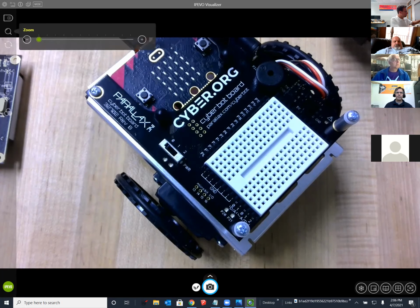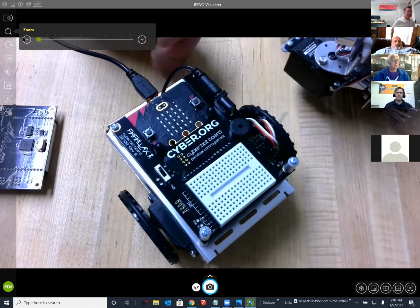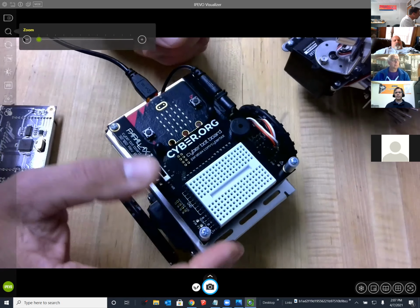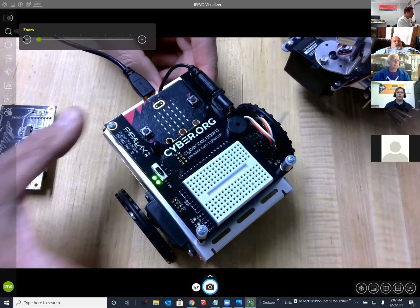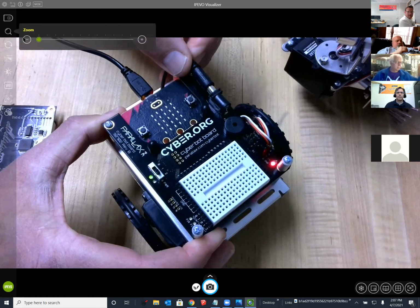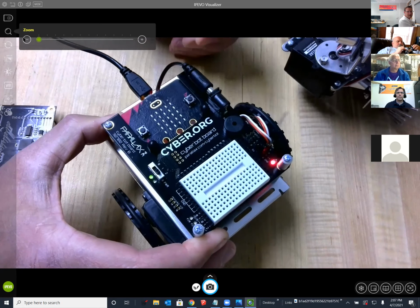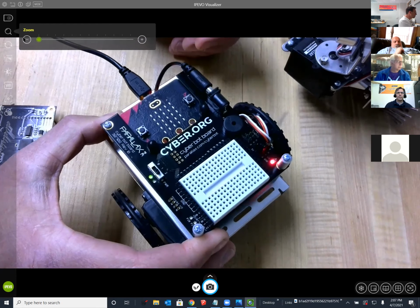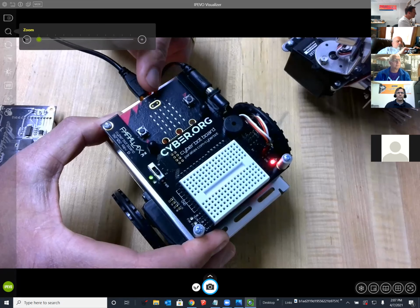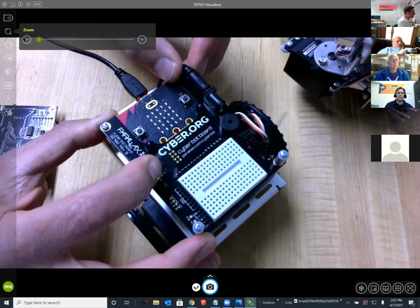Okay, so this particular issue, we had one red flashing light on Monday, and I want to show you a false positive that I've observed that I've seen other customers fall into as a trap as well. So the situation is that the robot is on, and in this case, my power jack is not plugged all the way in, and I see that red light, but that power jack sure feels like it's plugged in. All right, but it is not. And so what's happening is the power supply is low, below 5 volts. There's not enough current or voltage to do anything, and it's not even wired to do anything. But the battery pack is actually good. I have 7.5 volts. So when you plug that in all the way, and then you cycle power, that is gone.